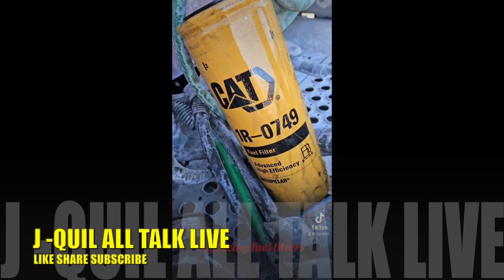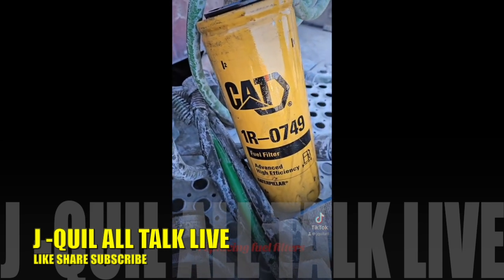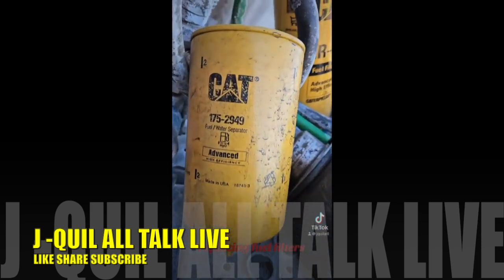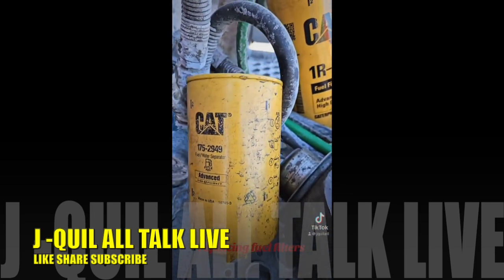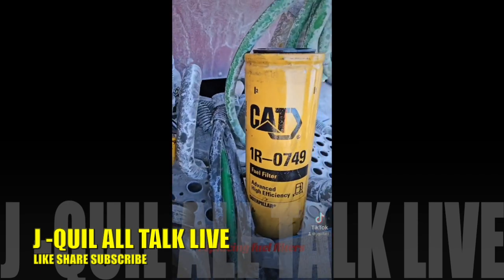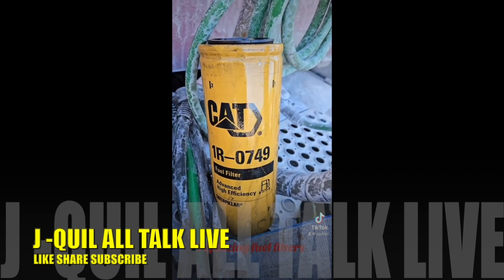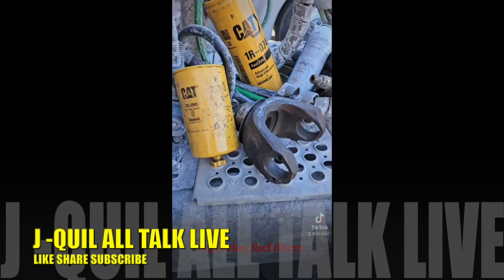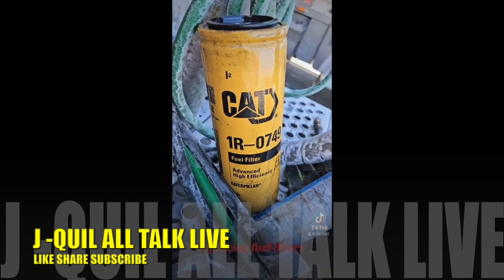All right, so that's the part number right there. 1R-0749, that's the part number. All right, so like I said, it's the old one right here. Part number, this is the water separator, 175-2949. That's the fuel filter. Diesel fuel filter, all right? Diesel water separator, diesel fuel filter.